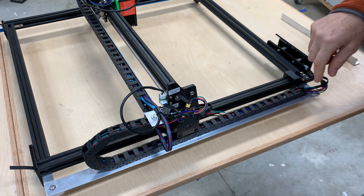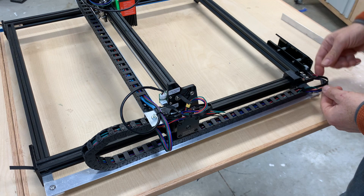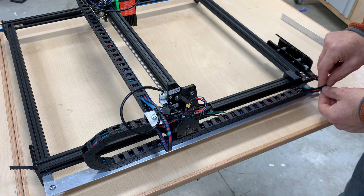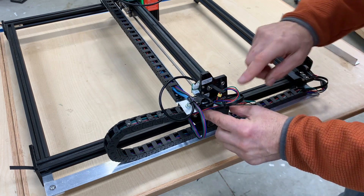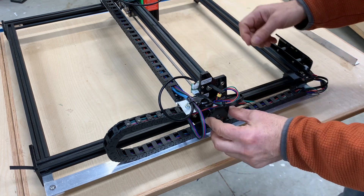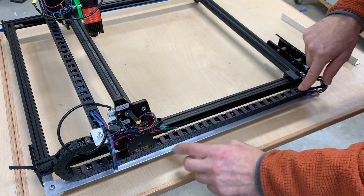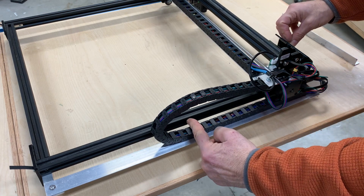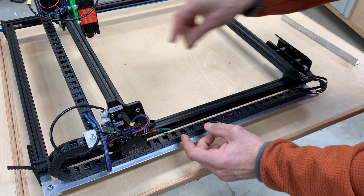For the wiring, I took off the cable protectors on both axes. You have eight wires from this eight-wire socket — four go to this stepper motor and the other four go to the stepper motor over here. That's a long wire, so I split those apart. This section of the drag chain never really moves regardless of how much travel there is here.